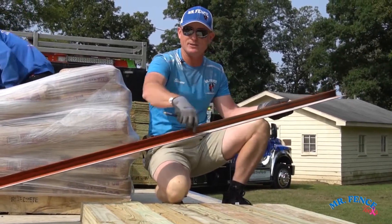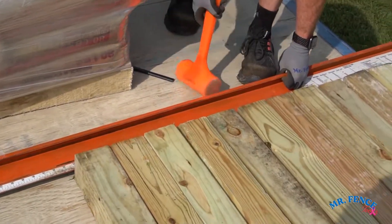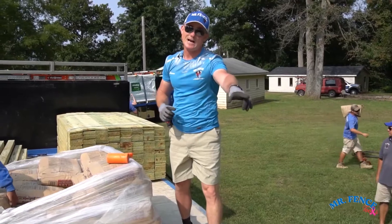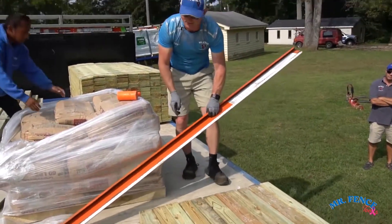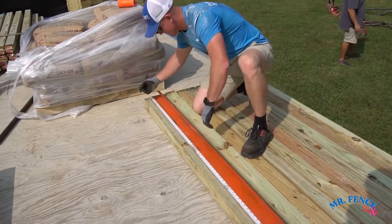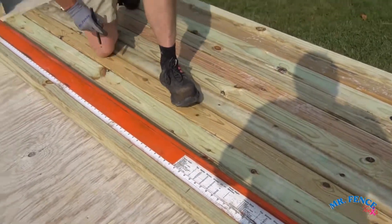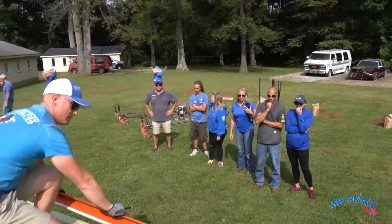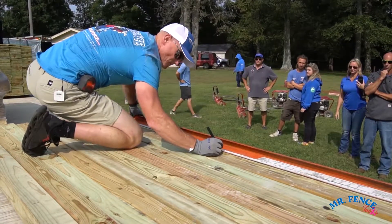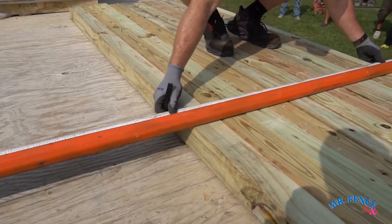So just for today, I'm going to use this side as my even side for my top. I use this as a straight edge and I can look down there and see they're not all lined up. So right now those are all perfectly lined up on this end. Once they're all nice and even, I'm going to take this, turn it sideways, line up the right side or the zero mark, and mark my post. 27, 54, and 66 is my ground level. Once I do that, I mark the other side — 27, 54, and 66 — then turn this sideways. It's that easy to mark out nine posts.